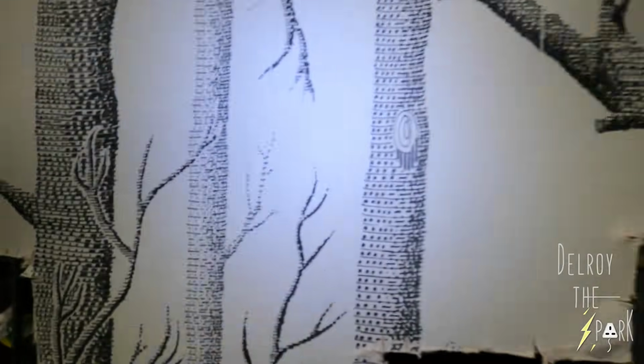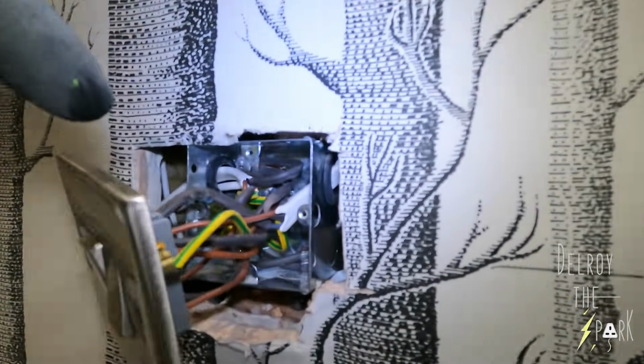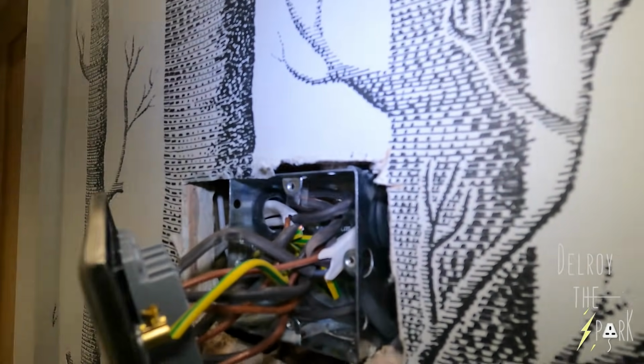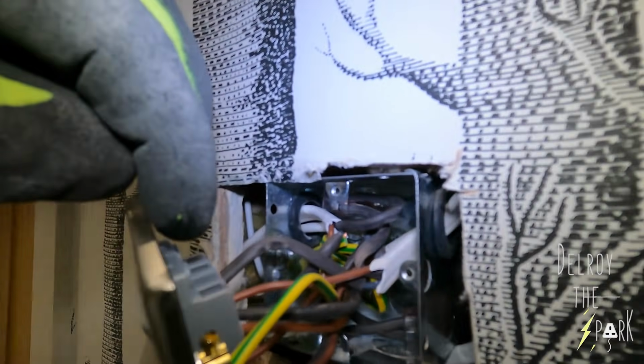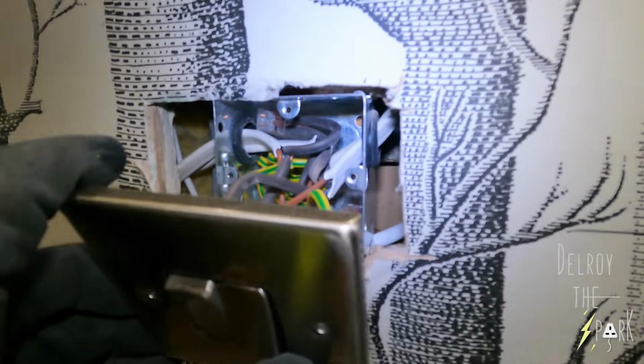And the 2 strappers, one's coming from that switch, one's coming from the switch up there. You put one in L1, you put the brown in L1, the brown underneath. The black with brown on it, you put it there, put the other one underneath. So it's simple, it's nothing hard. But when you don't know, you don't know, okay?